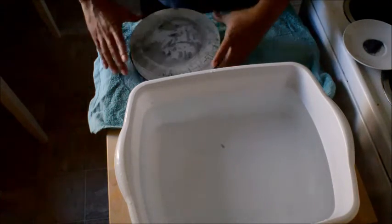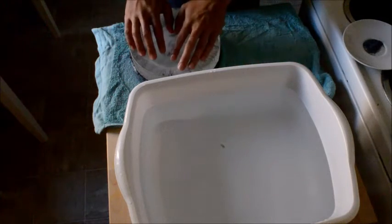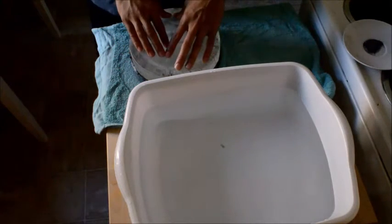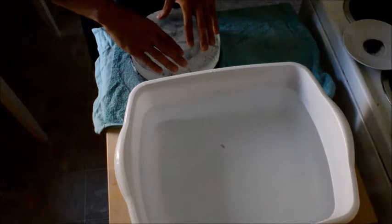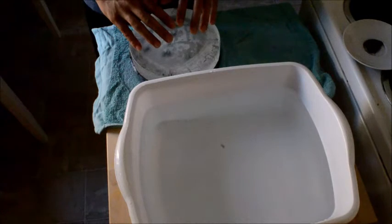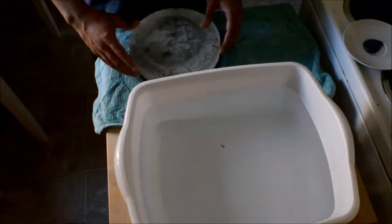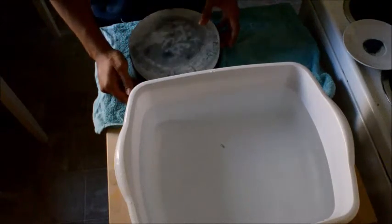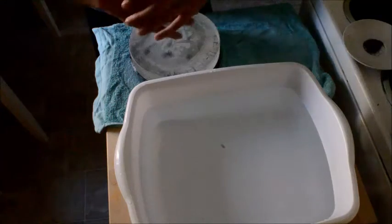The randomness is actually why I've placed this on the corner of my counter. I would move it back and forth 10 times, and then move my body and shift the mirror by an arbitrary rotation. And that's the randomness. So those two things ensure that I grind evenly. And the interesting thing is the silicon carbide will actually bite into or grind against both the glass and the tool at the same time. So the tool actually forms with the glass, and that's how we get the parabolic shape.